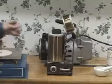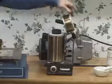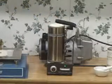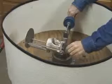This is an electromelt. The sterling silver is added where it will be heated to 1800 degrees. The built-in pyrometer keeps track of the temperature. This is a spin caster. By turning the arm, a spring tension is applied. The crucible is held at the ready by this pin.